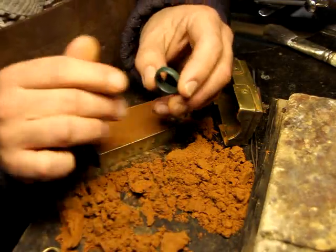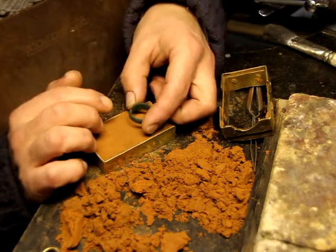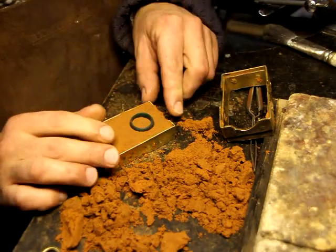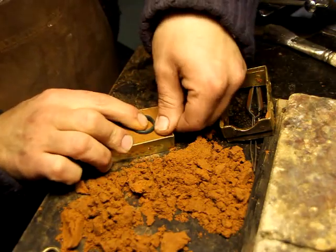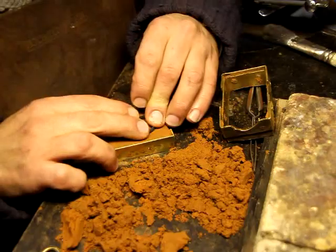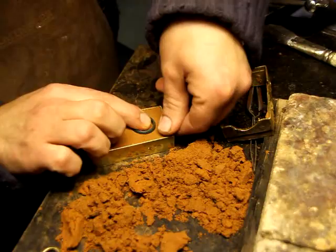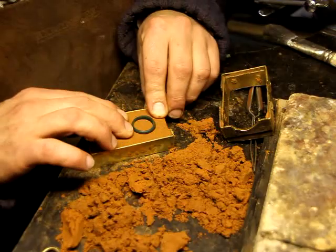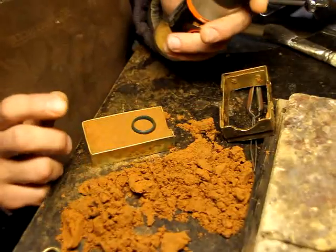We take the form we're going to cast. I'm going to cast this ring with the narrowest part of the ring down in the mould, so the ring itself is pressed halfway down into the clay. You have to be a little bit clever with the form you're going to be casting. It takes a little bit of experience to know how to put the wax into the clay — not all shapes can be cast like this. I probably cast 90% of what I do, maybe more, with this technique.